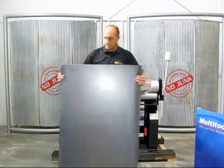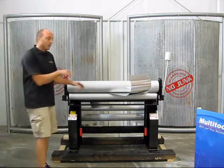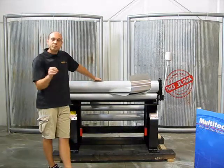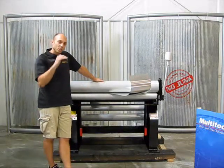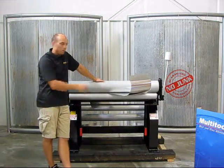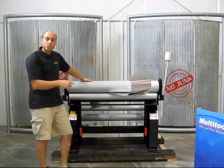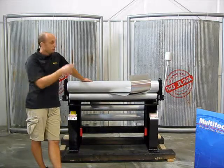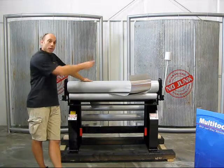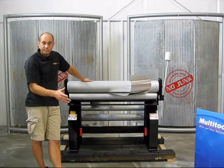This is a four-foot piece of 16 gauge. Six tubes come with the four-foot model with 16 gauge capacity. If I want to vary my radiuses larger than those tubes, I drop that bottom roller down and can make it pretty much whatever I want. This four-footer comes with a counterweight. Our six-foot model comes with five different radius tubes, dual counterweights, also rated for 16 gauge capacity. And then we have a long eight-foot machine that comes with two counterweights and five radius tubes as well, with an 18 gauge capacity.